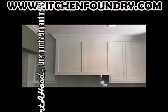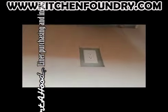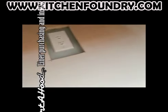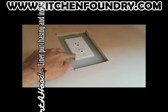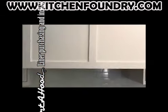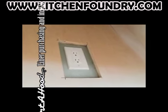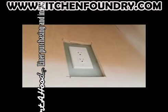Here's the box that our contractor built in the project. It is going to be an outside width of 42, inside width of 40 3/8. I see that he's left an outlet up here, and this is actually against code in California. Typically in these boxes, you have no removable panel, so you can't access them later. And years down the road, if that outlet had some type of issue, it's not serviceable. You'd have to drop the whole ventilation hood inside the house to get to it.